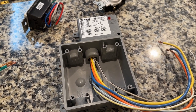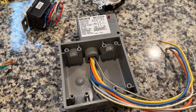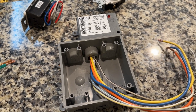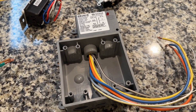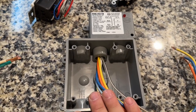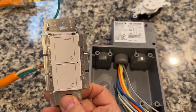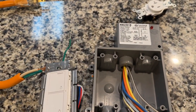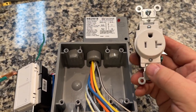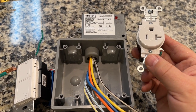So I'm building a smart switch for it. I have a Lutron Caséta smart switch system, so what we're doing today is making the plug for this fireplace smart so I can control the power supply for the fireplace and make sure it stays working. We're going to utilize this relay and wire in this Lutron Caséta smart switch to a single-use 20-amp 120-volt outlet.